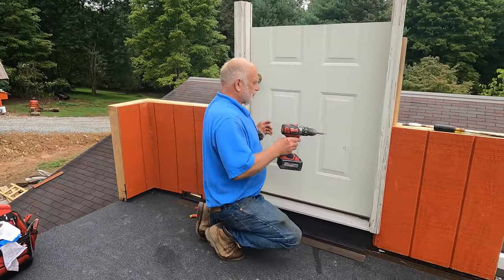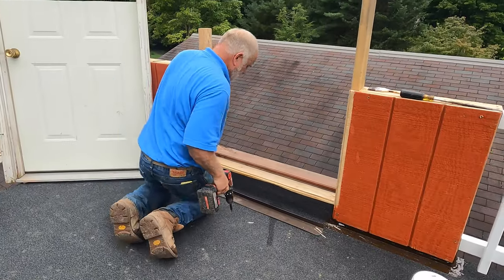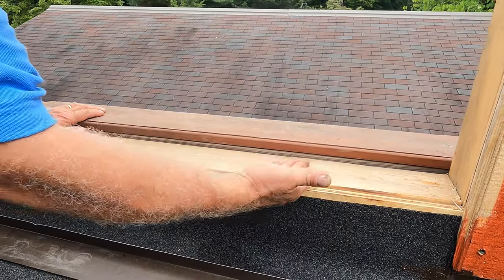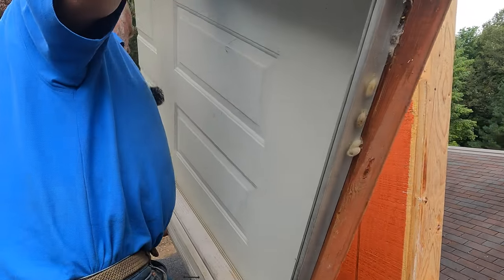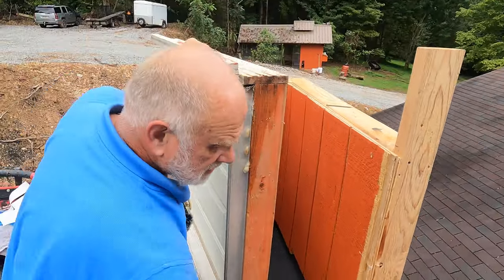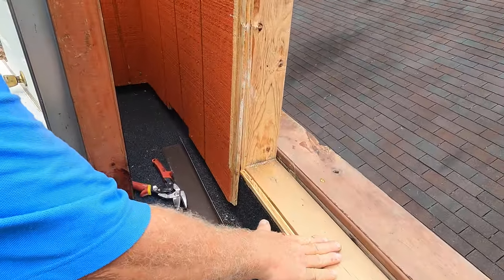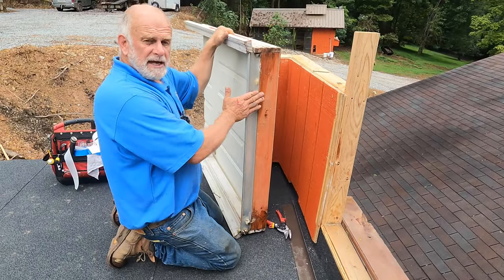This video is going to help you understand how to do this. This is one of the most important parts of a roof if you have a door right there. I just removed the door — there must be a pan here. A pan is what sits underneath this door. If wind blows, the water will blow underneath this into your house.